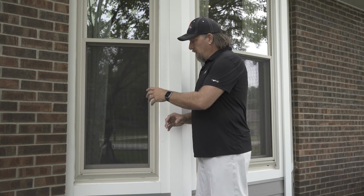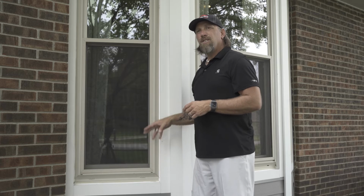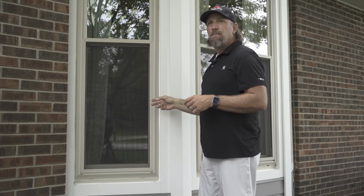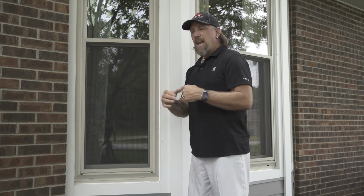So for example, a lot of the exterior trim would not have to be removed, but the exterior stops would have to be removed. So in a double hung like this window here, the sashes are removable, the exterior stops would be removable. The jamb liners inside the windows that operate the windows actually fold out, and all we're left with is a frame with interior stops.